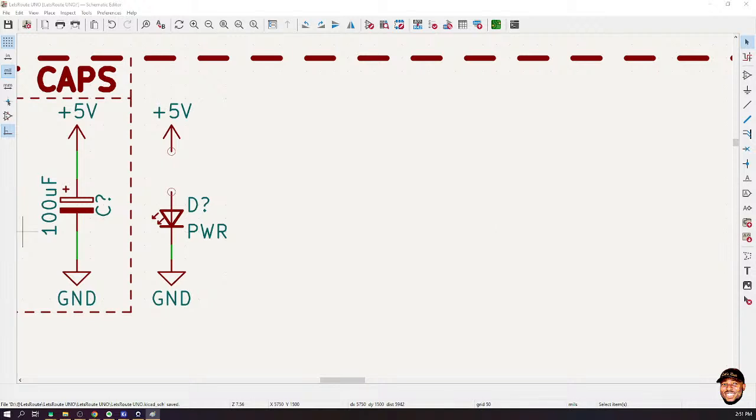All right. So the situation at hand right now, can you all see my paint software? We have 5 volts and we want to power an LED. This LED we know will drop 2 volts on forward conduction. Though the LED could allow 20 milliamps of current to flow, we want to restrict the current to just 10 milliamps because we don't want it to be too bright. That means we will be drawing a current of 10 milliamps from this 5-volt power source.